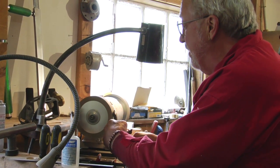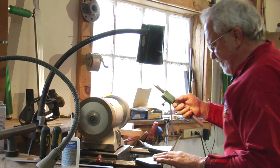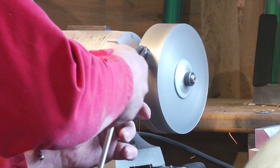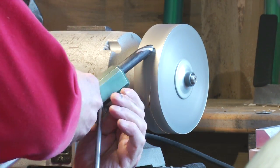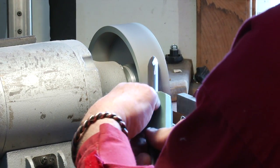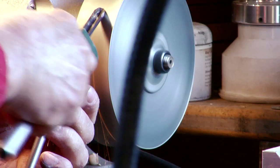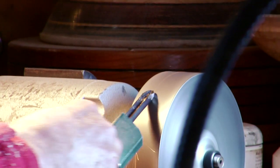This is a 180-grit CBN wheel and this one is an 80-grit. Over here I jump to hole two, which would be the first bevel grind or relief grind. I like a small rubbing bevel — on a 5/8-inch tool I do it about an eighth-inch long, and on the smaller tools they're smaller. Small rubbing bevels are much easier to control directionally and a lot friendlier to use with that tucked-in back corner.